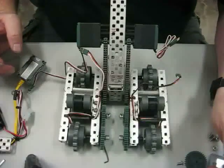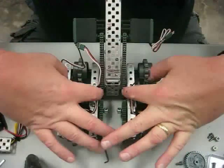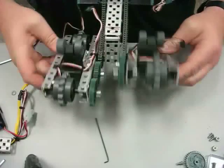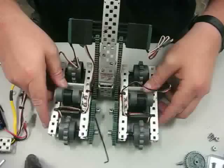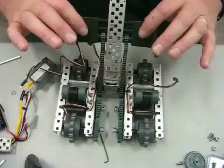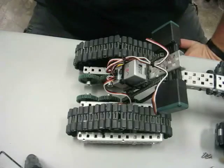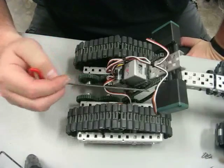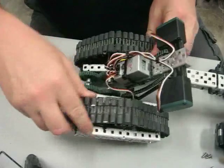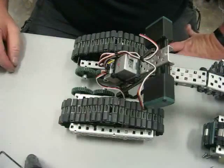Here we have the motorized pivots — we've got two servos, a chain sprocket to a larger chain sprocket that is attached to the frame. So we have independent suspension and should be able to control these tracks very, very precisely. We do have a little bit of slop, which is good because it allows movement of the tracks without loading up the servos. We just have to put everything back together and see if it works. We're all buckled back up — two servos, chain drive down to a sprocket attached to the frame, independent suspension maintained. Let's go put a battery on it and see what happens.